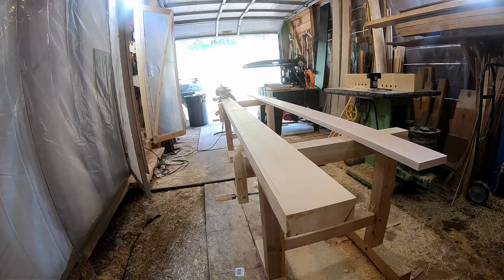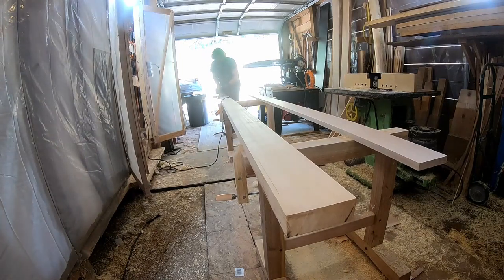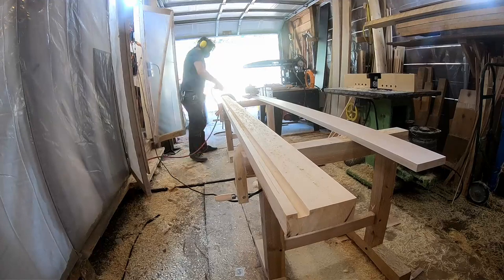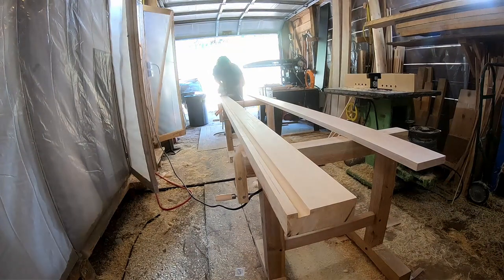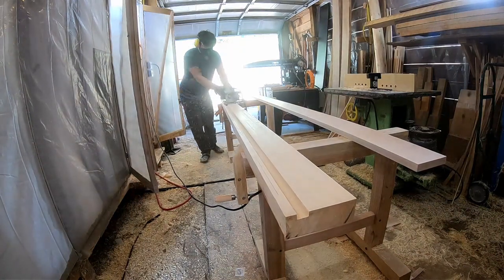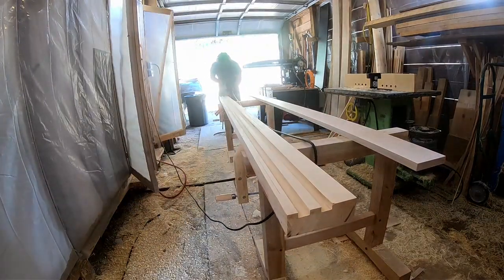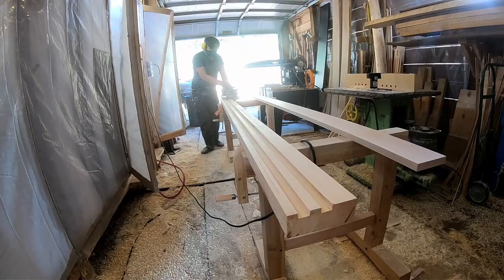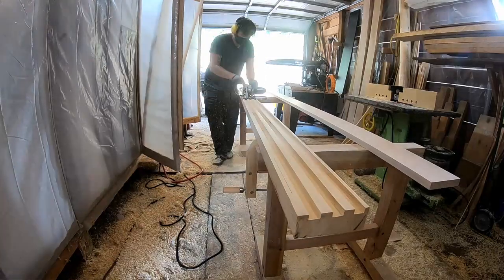So for the three big grooves in this kamoi, I have a different grooving tool that I'm using to do the heavy hogging. That has specific sized bits for the different width grooves and quite a bit of power. And once I've hogged out the bulk of the material, I'm going to switch back to my other Groover, which has a wobble blade. Basically, you turn these two wheels and it makes the blade tilt on its rotational axis. And the more it tilts, the wider its cut is. But it's very sharp and it leaves a really clean cut. So I don't want to ruin it by hogging out a ton of material, whereas this can really do a lot of the heavy lifting.